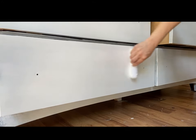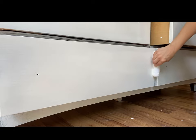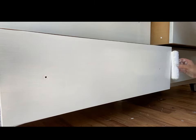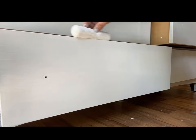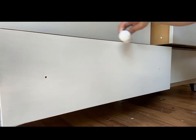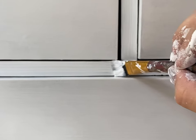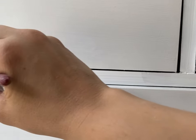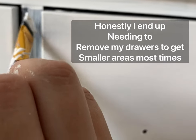When you're doing this method on the edges, your paint will pool up a little bit and then start to drip if you don't clean it up, because I'm going all the way from one side to the other. What I do is just clean it up with the sponge roller — a little dabbing, a little rolling, sometimes using the drier side of the sponge roller to absorb more paint. I try not to touch the face of the drawer that I've worked so hard to get nice and smooth. I also have this little brush that's the perfect size for the spaces between the drawers.